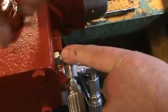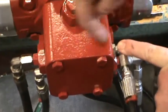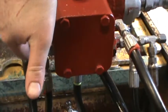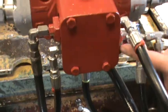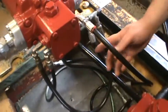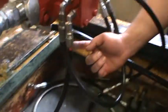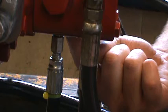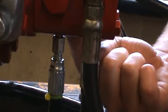This one here will check the relief on this side. It's always opposite of the relief, and then the same thing for the other relief — it's down below here, so you'll check drive pressure here for this side. For charge pressure and stroke, you'll be pulling that off the motor block right here. It's the only plug on that side — same thing, it's a hex plug, takes a 9/16 inch wrench.